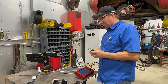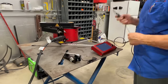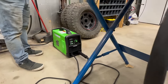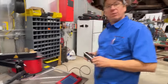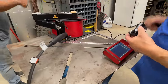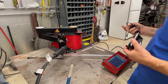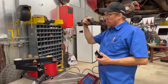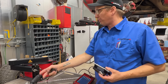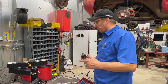Now we try out the new machine and see how the Harbor Freight 65 plasma cutter works. It's a two-wire interface to attach it to the machine. If it doesn't have a port, you just tap into the trigger switch — open up the handle, find the two wires that go to the trigger, add a couple of scotch locks and some extra wire, and you're good to go.